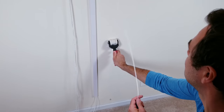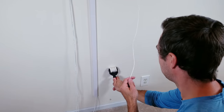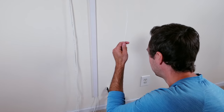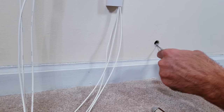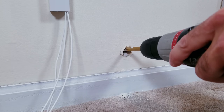This might take a little bit of time depending on how thick the insulation is that you're trying to go through, but after a couple of minutes I was able to work things down to where I needed it. Once I had things at the bottom, it turned out that the half-inch hole didn't provide enough space for me to fish the magnet out, so I did have to make things slightly bigger — I expanded things to about one inch, which allowed me to pull the lead through.